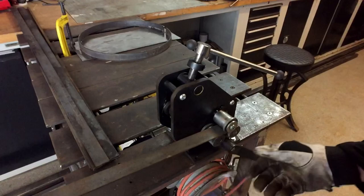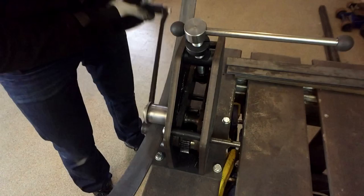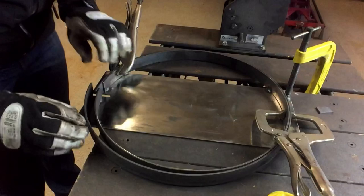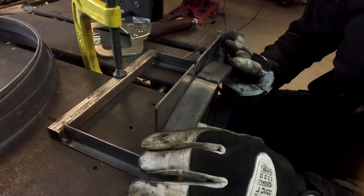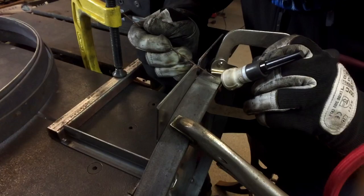I'm all about learning, but I'm also about adding little bits of workshop tools where appropriate. Appropriation is something that my wife might disagree with, but I added this ring roller to the stable and it is a beast of a machine — I couldn't do the surrounds without it. I made this small jig to help with getting uniformity across all the pieces. When you're making more of one of anything, you need to make sure that you're getting consistency. The jig let me get the cuts across so that when you overlap and cut it down the middle — a bit like wallpapering — and then bring the two sides together, they're completely square and true to each other, which means you can then just tack weld or weld the whole seam down, and it's a perfect fit.